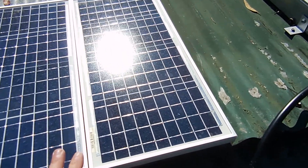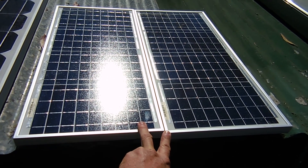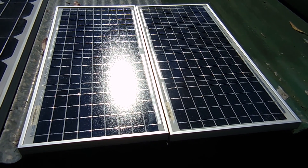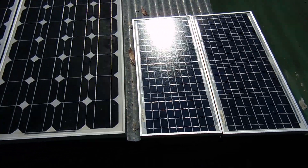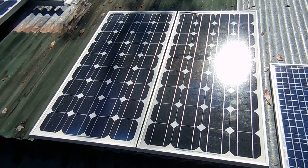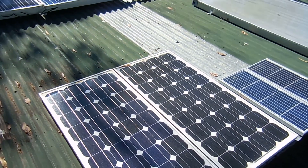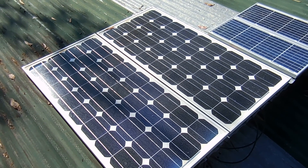Over beside here, these two panels are for that circulation pump — two 12 volt panels wired in series for 24 volts, as it's a 24 volt pump, just to get the lift from it. We needed the extra lift; the 12 volt may have done it with its 3 meters, but the 24 volt with 6 meters we wouldn't have a worry. You don't need a large flow rate, just the lift to get up onto the roof. These other panels here are wired in parallel — this is the 12 volt system that charges the 12 volt battery in the pump shed. In winter I'm actually thinking of making a stand to angle these up more so they face the sun more. You can see there's shadowing on there as well, and that's what's charging the 12 volt battery down there for the pump setup.